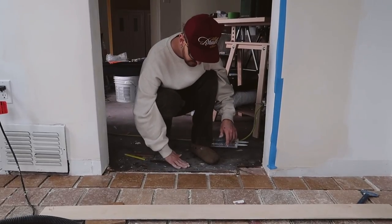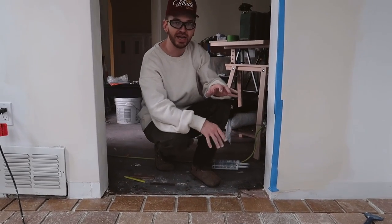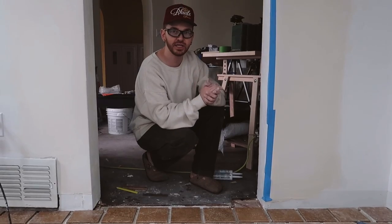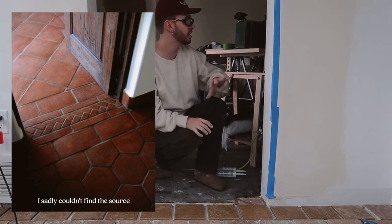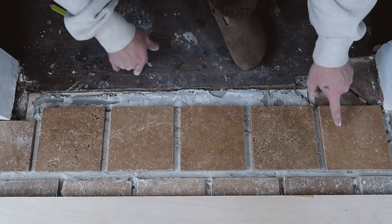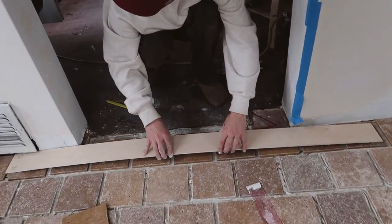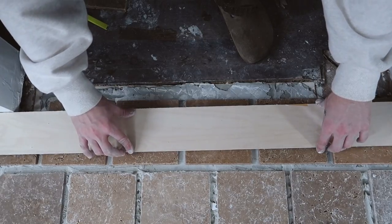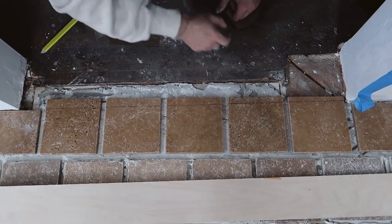We have wood floor in the dining room and the tile we're putting in now, and I really want to do a braided tile threshold — it's a little daring but I want to do it. It'll be a tile detail that's the width of our archways, going in this archway and the larger one over there. First I want to cut all the tiles to the exact edge. I have a straight edge here, so I'll mark the cuts and cut them perfectly in alignment.